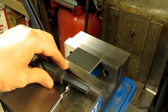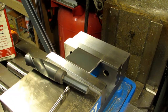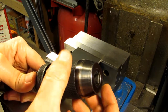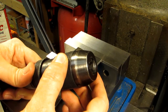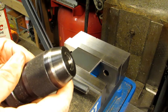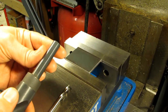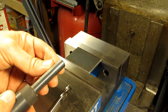One more thing about drills: this has a half-inch shank, but that doesn't necessarily mean you can put it in a half-inch drill chuck. Especially keyless chucks — this happens to be an Albrecht style — these have ball bearings inside and are self-tightening, so as pressure is applied to the drill it actually tightens the chuck even more, and it can crush those tiny ball bearings. So half inch is actually the largest drill you should use in this. The other problem with using drill chucks with larger diameter drills is they tend to spin in the chuck and score up the shank, making them useless. Even though these have flats on them for the chuck jaws, I still like to hold these in a collet because it's a lot more sturdy.